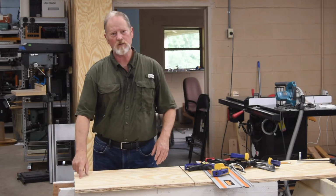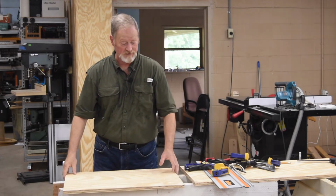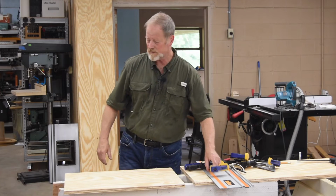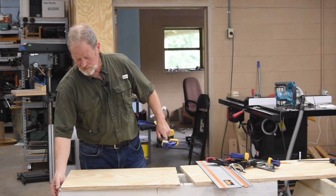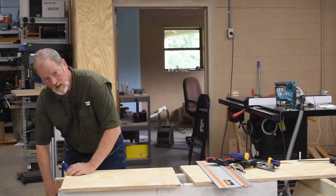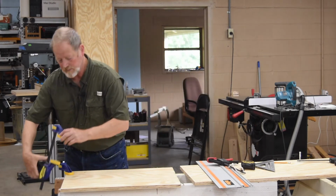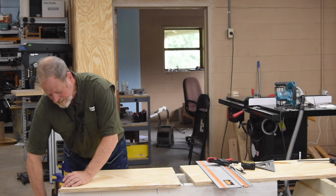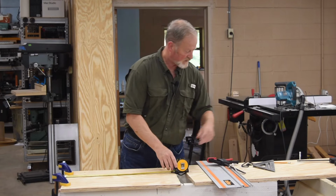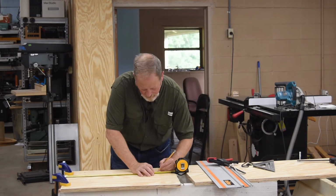This last panel is 21 inches this way, but I'm going to turn him around, and there's a reason. Remember I told you that these panels have a tendency to slip when you push through the track? Well, this is going to be no different. I'm going to pull this sawhorse out a little bit. Every inch I get distance on this is going to create more moment resistance, and that's a little engineering lingo there. So same procedure as before, and the only reason I'm putting this in is it pays to be aware of where you are and how you're making a cut.